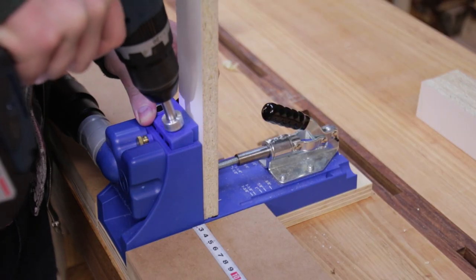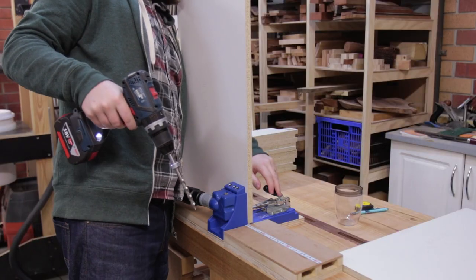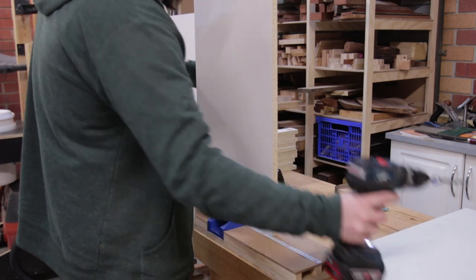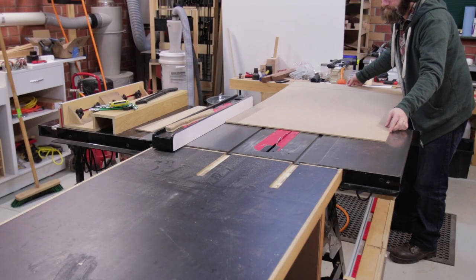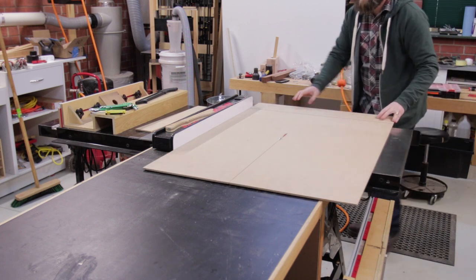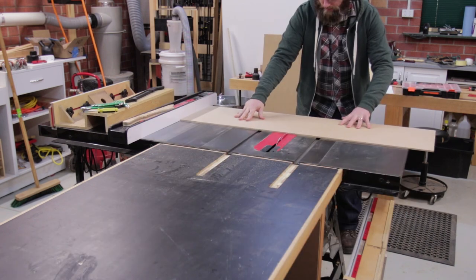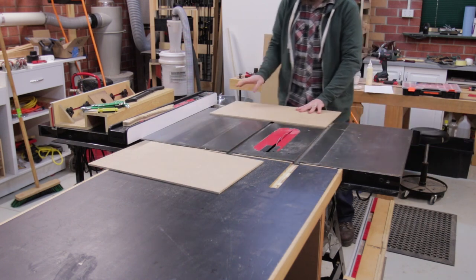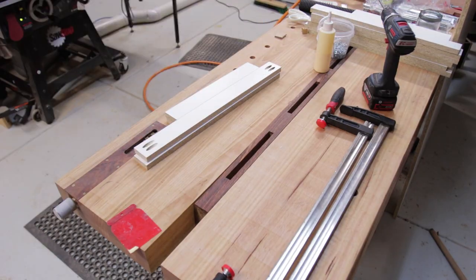Just like the other drawers and cabinets, this is going together with pocket screws. Unlike the other drawers, this is just getting a nailed and glued on MDF base. I normally wouldn't recommend this, but because the drawer depth is so shallow and I won't be holding particularly much per drawer, I think it should be fine. If not, well, I can always take the base off and glue on some plywood down the track.